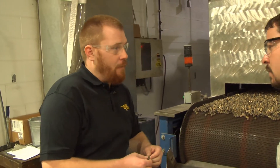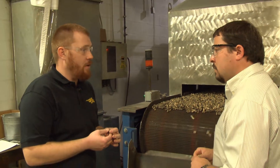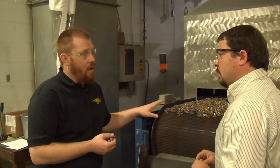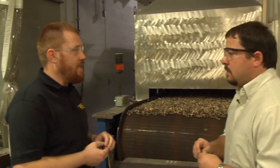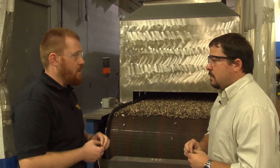After the parts have been first drawn, they get washed and run through our annealing furnace. This furnace is running about 1,130 degrees — it takes it back to dead soft so that we can work it again in the second draw process.